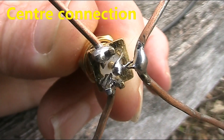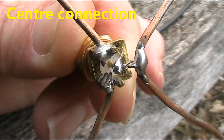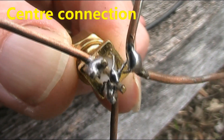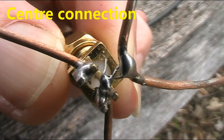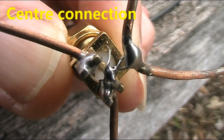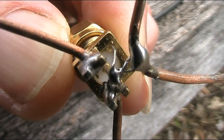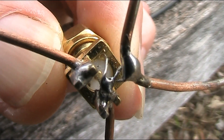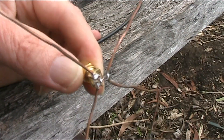Hopefully this is clear enough to show the connections. I've made it from a single piece of copper wire. The ends are where my thumb is — I've just soldered them to the mounting prongs of an SMA socket. The middle connection goes to the other side of the two loops, and I've just used a short piece of wire to solder and join it. Not ideal — I should preferably bring it closer into the middle, because even a few millimetres, or even a millimetre, does affect performance on 23cm. Though for receiving, this is probably okay.